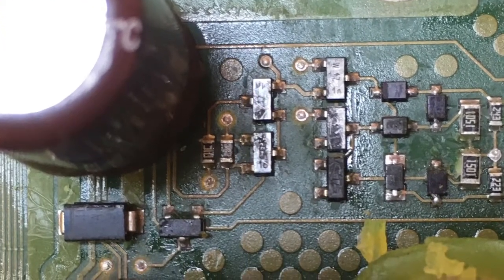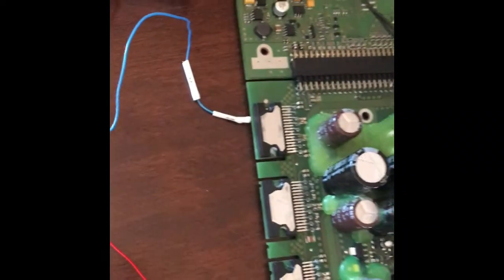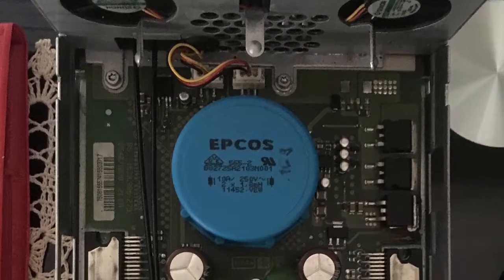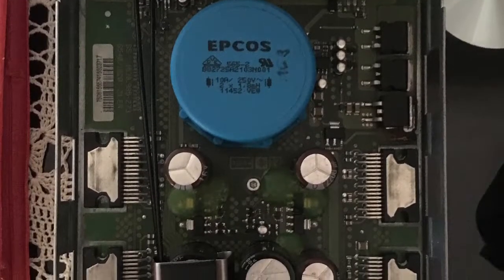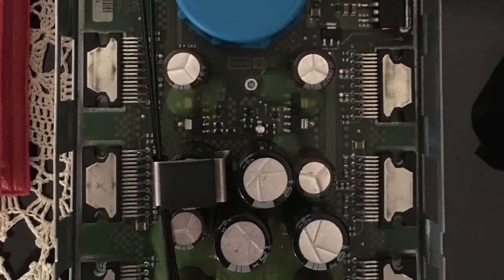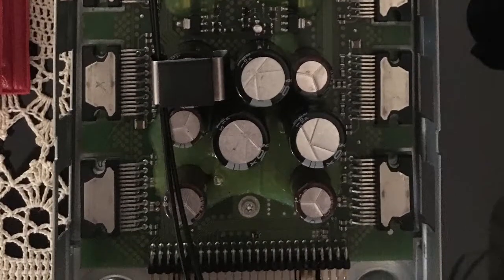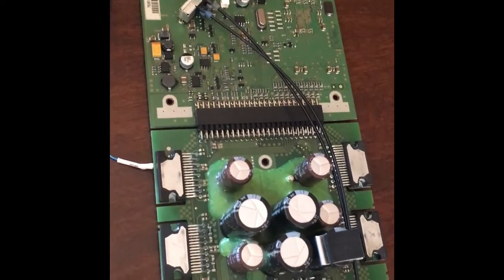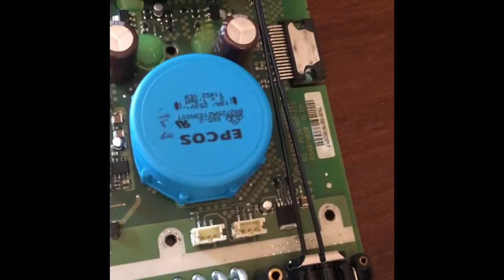Use an external 11-volt battery, welding two wires on the main connector of the big board, pins 1 and 2. Check that on pins 28 and 29 there is 12 volts. Unplug the battery, connect the small board, and connect the battery again. Sometimes touch the components with your finger — if you feel high temperature, unplug the battery and figure out what is happening before breaking something.